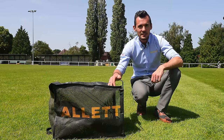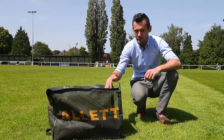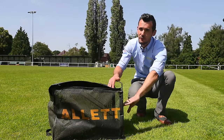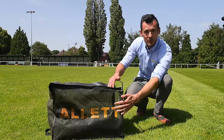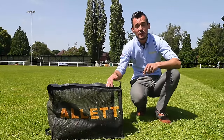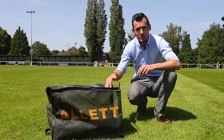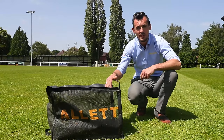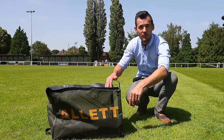The Uplift 86 has a 90 litre capacity grass bag. In that 90 litres, you can have up to 40 kilos of wet grass, so when it is half full, ideally you want to be emptying at that point. It's manufactured from a mesh fabric — the idea being that because of the amount of air coming from the machine, you want to expel that as quickly as possible. It's always best to keep that mesh clean after every use.